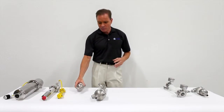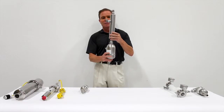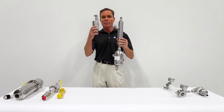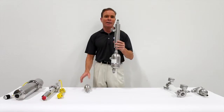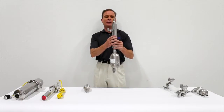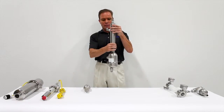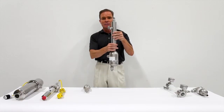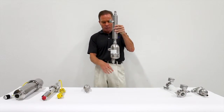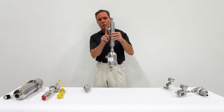Because the gas is expelling under pressure, a little bit of water vapor will come out in the form of droplets. We then need a device to separate those water droplets. We do so with this system here — we call it an expansion chamber. As the water droplets exit the pipe at the top of the tank, they're entrained in a small pipe, meaning the velocity would carry those droplets into the destruct if we didn't incorporate this device. What happens is the pipe sends the gas to the bottom; water droplets are removed as gas velocity slows down, leaving the water to fall into the drain valve. The drain valve allows water to fall out while forcing the ozone gas to travel out the correct port and ultimately into the ozone destruct.